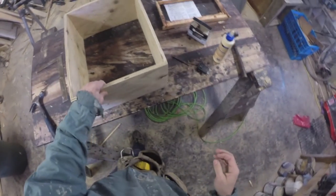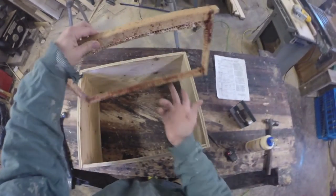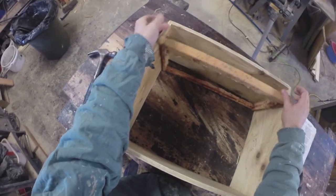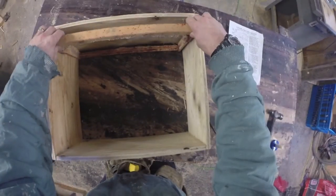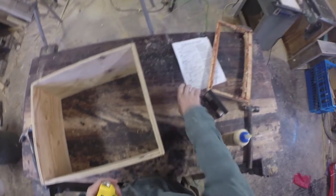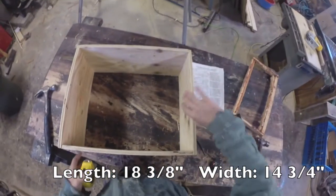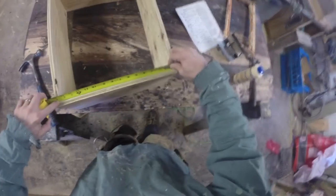If you're out of square, you've probably not cut the wood properly or you've got a wrong joint. The last test is to make sure a deep frame — a full 9 and 5/8, or actually I think 9 and a half — will fit. You're going to have a little room on the bottom, but you're worried about the edges here, making sure you have that little space in between and your measurements are correct. Your inside length should be 18 and 3/8 — that one's on the money. And your width is 14 and 3/4 — there it is. Our 15 and 3/4 inch piece minus two half inches brings it down to 14 and 3/4.